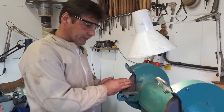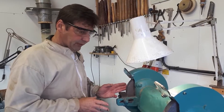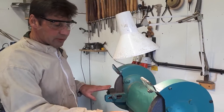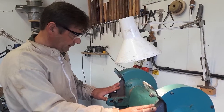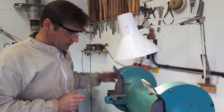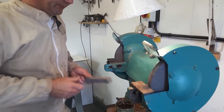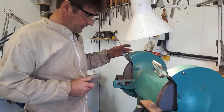As you're using the wheel, you should never grind any non-ferrous materials — i.e. aluminium or brass — on grinding wheels. But even using steel, high-speed steel, or carbon steel, metal will be deposited on the wheels and they will gradually become very slightly out of true, causing bumping as you grind. So you need to dress the wheels.